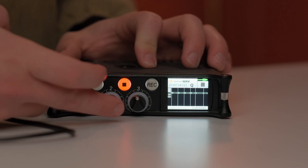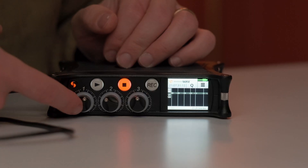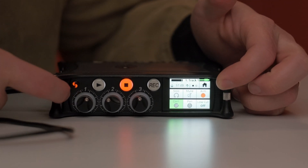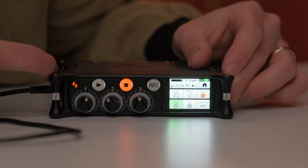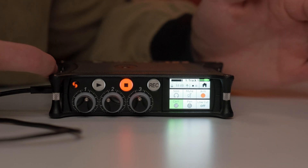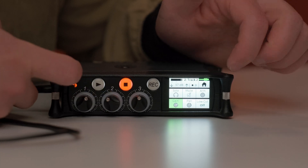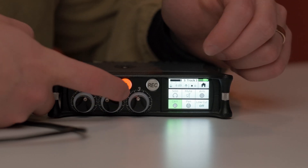We click this button here — when you click one of these buttons, it's actually that track you're controlling. One, two, three — we have three preamps in here, that's why it's called the MixPre-3. There's also a MixPre-6 with more channels. The main thing is your gain here. You click this and you can now control your gain. I've noticed I typically keep it at about 60-75%. You want it to be armed. If you wanted to record the second one, you'd click arm on that. But we don't want that because we don't want extra memory — we're recording one track because that's all we need.